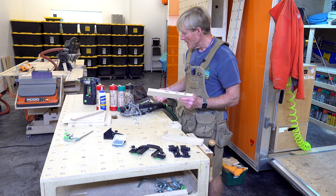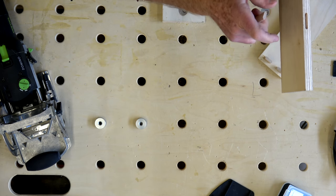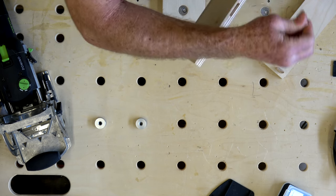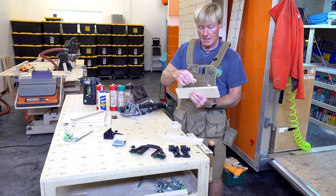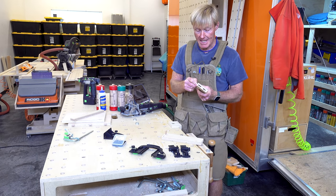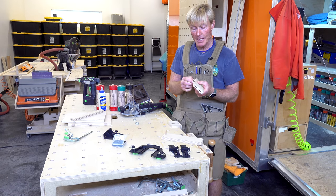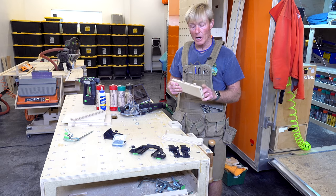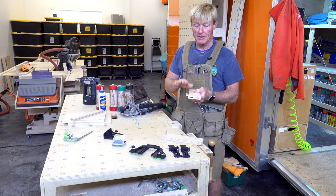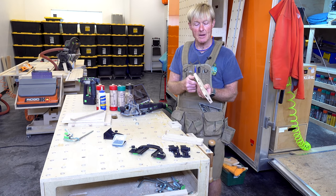Here's an example of the cuts you get by rotating the width dial. It isn't about having a wider Domino — it's about having some play for assembly. The same Domino fits in all three: a snug fit, a little bit looser, and finally quite a bit looser. You might use this for wood movement or assembly — possibly setting one or two mortises tight to index the pieces, with the others just for lining up the surface.